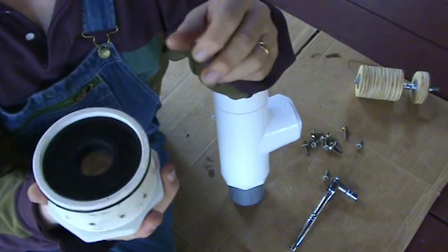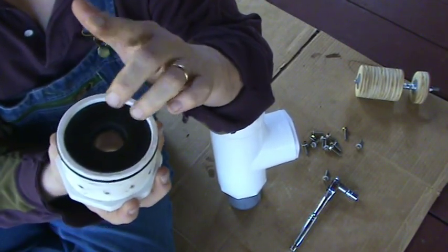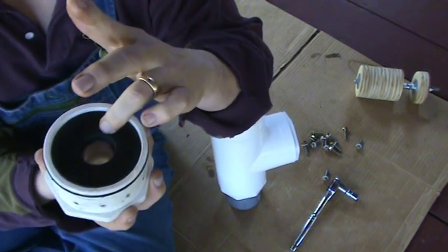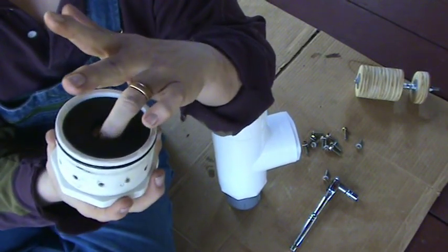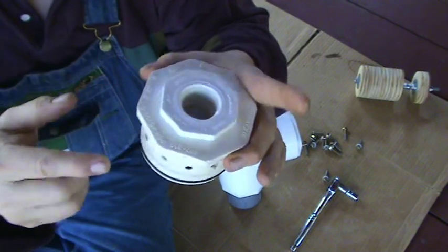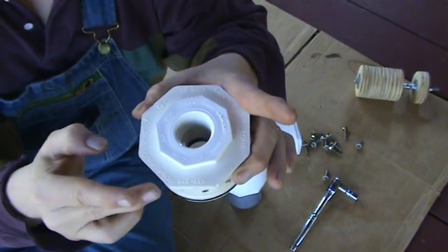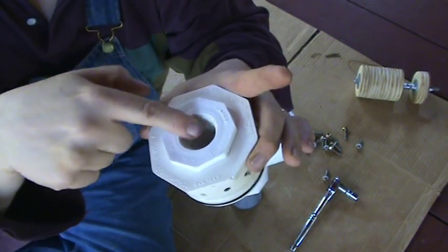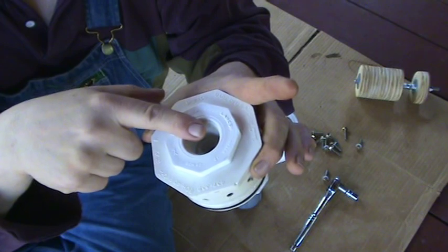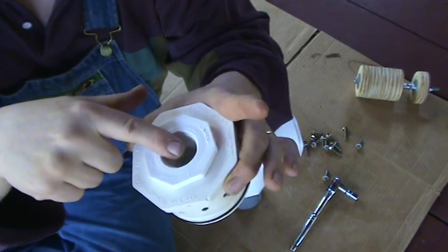Two other big modifications here: I've got a rubber bumper on here — this is a half-inch of neoprene sheet rubber that I've cut a donut out of with two hole saws. Underneath it, I've filled the bushing with epoxy. This is really two bushings — a 3-to-2 slip-to-slip with a 2-to-1 slip-to-thread — so it's got a threaded connection in here, which means I can attach and detach the triggering mechanism, whichever kind I want to use. It makes it more modular and more useful.